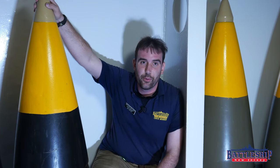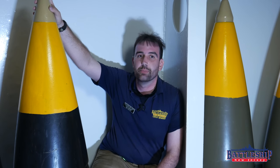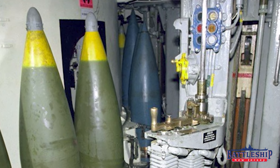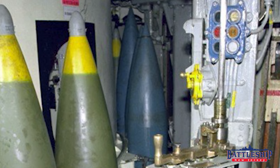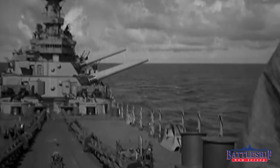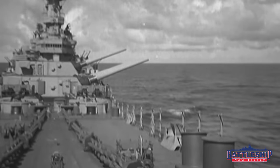For the Mark VIII armor-piercing shell, there is a training round called the Mark IX — that is what's known as a BLNP round, blind-loaded and plugged. Instead of being filled with Explosive D, it is filled with sand. The whole shell body is painted blue to show that it will not explode. It is still a real shell; it still has a brass base ring so you can fire it out of the gun. If you're firing on a target sled, you would use one of these — you don't need an explosion, you're just trying to put a hole in something, like using wad-cutter rounds in your revolver. Likewise, the Mark XIII has BLNP rounds called the Mark XIV and Mark XV — same shell body, filled with sand instead of powder, painted blue.